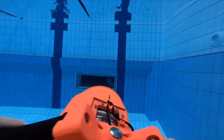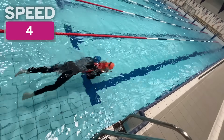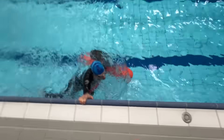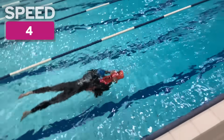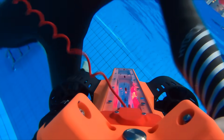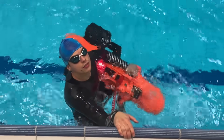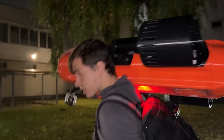And here is where we were kind of devastated. One motor quits for some reason. Speed mode 4 doesn't work — it turns off the ESCs after about half a second. It's really unfortunate because we didn't even see this one coming. It's likely because of the power these motors require while accelerating. But the good news is that we think we know how to fix it. We'll do that as fast as we possibly can and test the full power in Part 2.